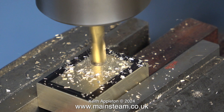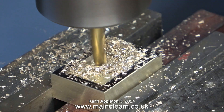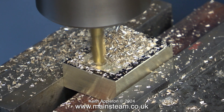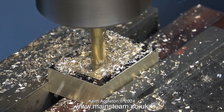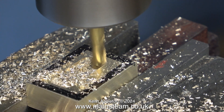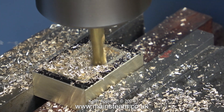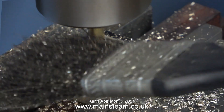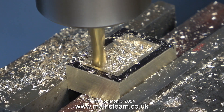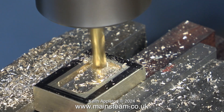You'll note that I'm starting the cut well away from the black lines — this is essential. If you start cutting on the line, the job could go spectacularly wrong. The cut is approximately one eighth of an inch deep. I should mention: I'm aware you need to always cut in the direction the cutter is rotating, but on soft brass it's really not that important — if it were steel, I would have to observe that rule. This milling cutter is part of a cheap set from RDG Tools. They've been perfectly fine, apart from one I destroyed by taking too deep a cut, too much pressure, and overheating it — that was when cutting steel without any lubricant. I generally avoid lubricant in videos because you can't see what's happening.